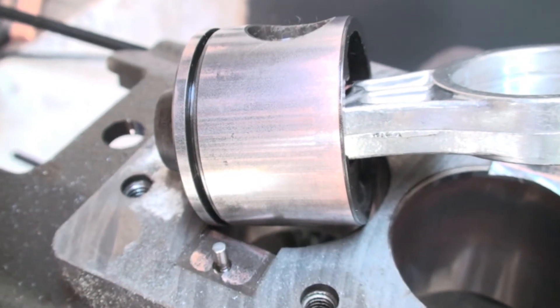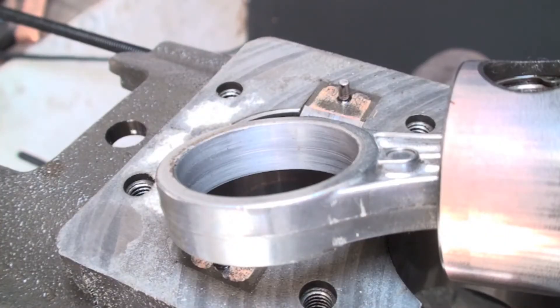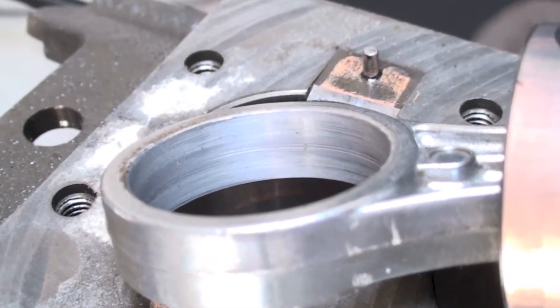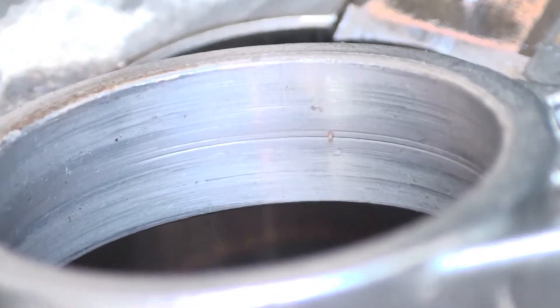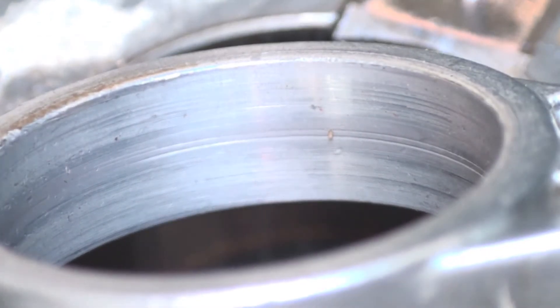With the same unit, one of the pistons looks like it's got some copper plating on it too, and some score marks. That makes the clearances tighter than they should be. Here we have a connecting rod that's an aluminum rod — if you look close on this one, you can see it doesn't look like there's any plating on the aluminum itself.